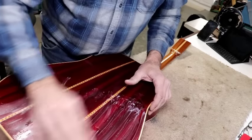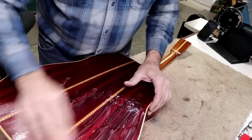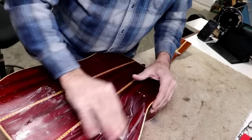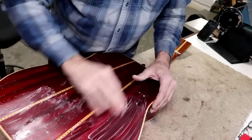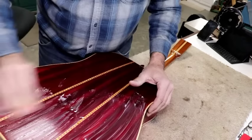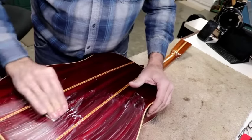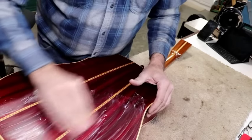If you had a totally clear filler, then it would be all right. And yes, I know about glue boost and all those other super glue type finishes, and I can't stand them. My eyes are so sensitive to those things, I just can't be in the same room with them. I don't like to use shellacs under it, because shellacs turn milky white if you sweat. I'm just not a fan of the shellac deal, even though it would work.